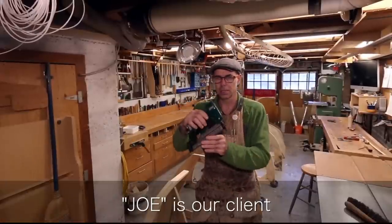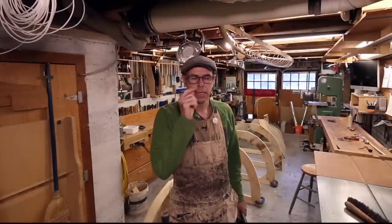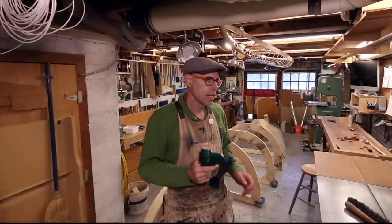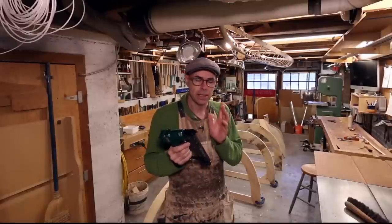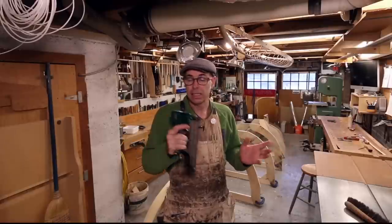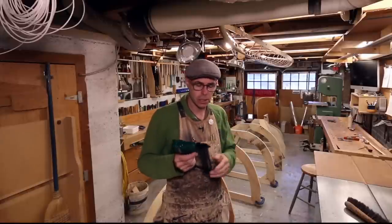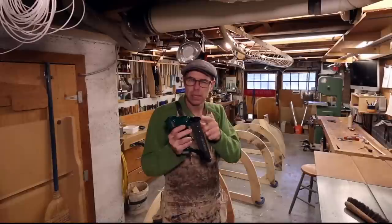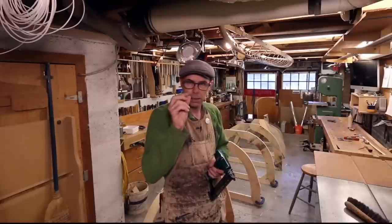So this showed up in the mail — Joe sent over this Omer stapler. It fires composite nails, and the idea being that when we start planking we'll be assembling our planks with this, saving me from having to play around with clamps. I have a feeling this is going to allow me to work quite quickly — as soon as I can get my planks on and tacked together with epoxy you can walk away, no clamping pressure needed. We've got our stringers underneath, and these are pretty short staples so even if they go through both layers of planking they'll only catch the stringer by a hair, and these nails can pop off without leaving a big ugly scar on the inside.